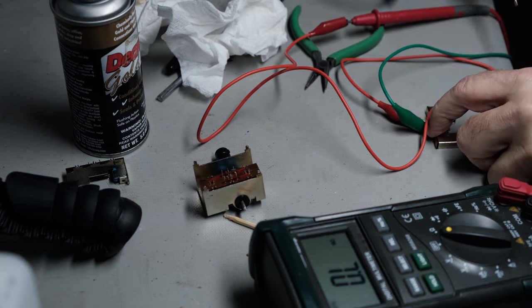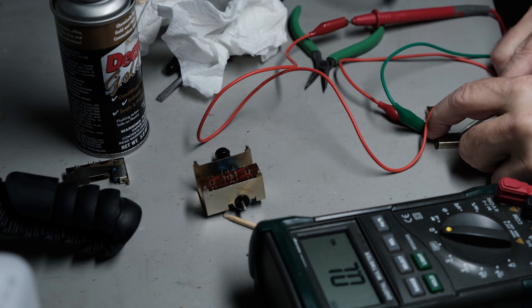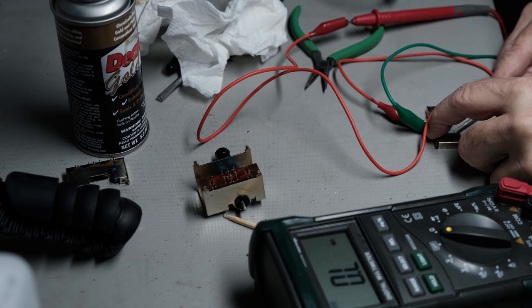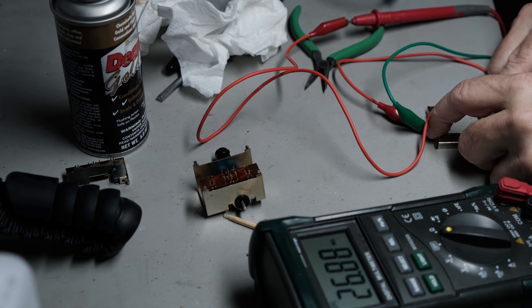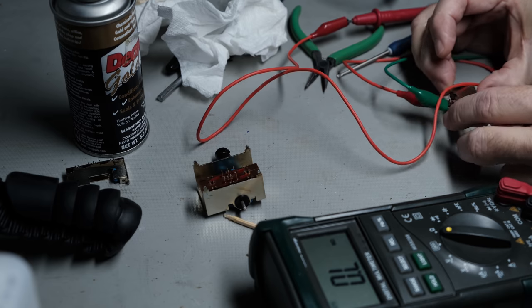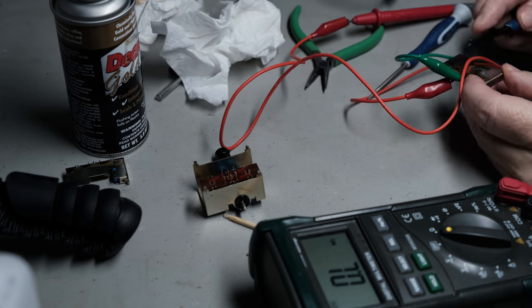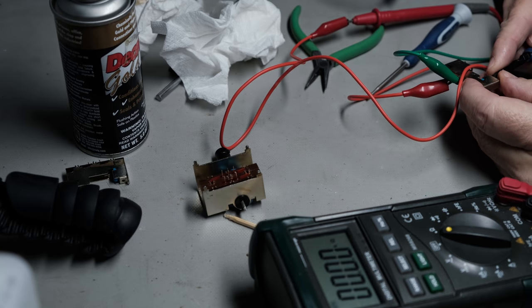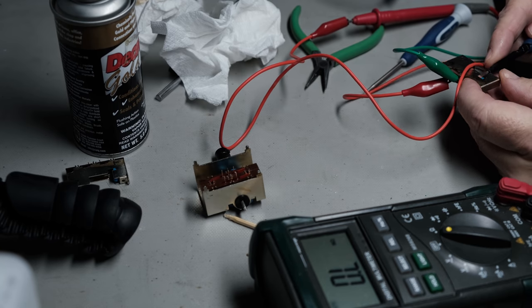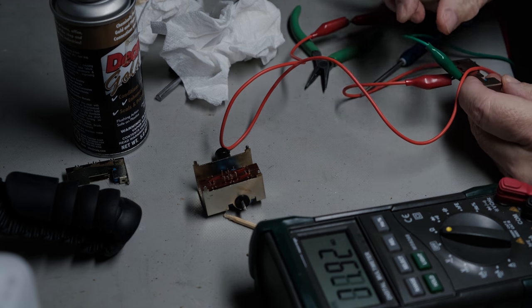So you don't have to have an oscilloscope. You don't have to have an Atlas Peak DCA Pro to troubleshoot. Those two tools are just very helpful to make it more efficient to troubleshoot. But one thing you need to have is at least a small portable digital multimeter. Not a $3 one from the flea market, but it doesn't have to be a $500 Fluke meter. But get on Amazon, a $30, $40, $50 digital multimeter will probably work out fine for you.